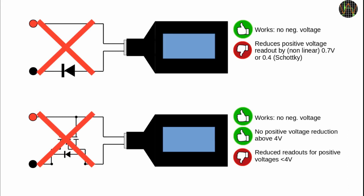I did experiments with additional circuitry that would use the voltage from the micro USB to turn the gate fully on, even at tiny voltages, but that means you now have to sense the input polarity in that helper circuit, and that needs to be done starting from millivolts and without drawing any current to not reduce the input resistance of the TC66. It all got way too complex for something meant as just-in-case protection.